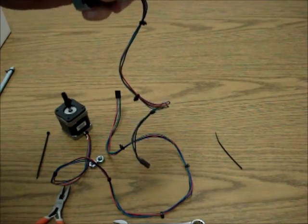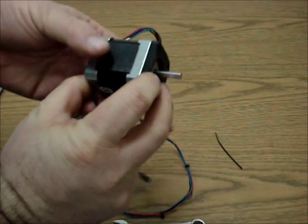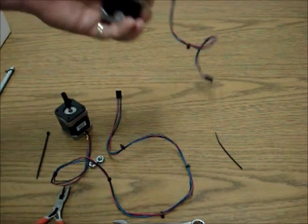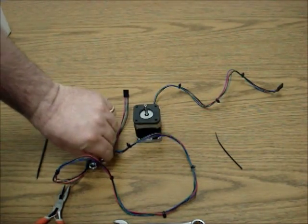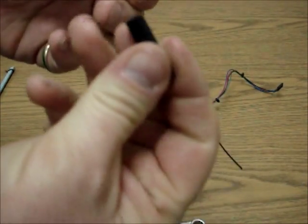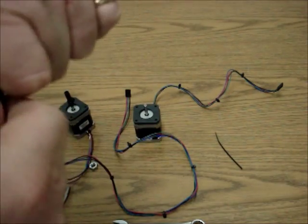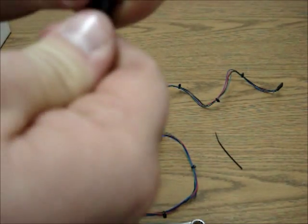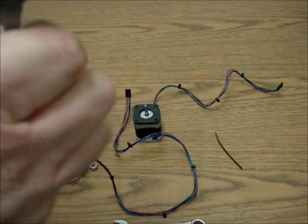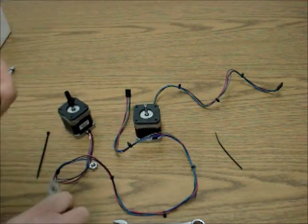Here's the second method - the method I like - but it requires a little bit more force to put it on there. In order to do this, you don't actually put anything on that D-flat. Instead, you're going to take your 5/16-inch nut, take your vinyl tubing, and actually thread that onto the vinyl tubing. It's a little hard to do when you start out, so you might want to take your pliers and kind of crunch it down a little bit - not much - and just twist it while you're in there, and that gives you a little bit of a starting point.